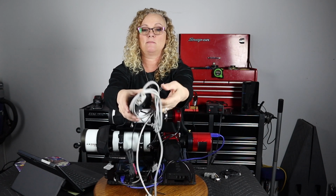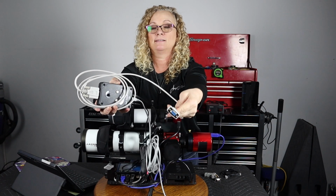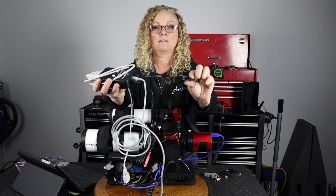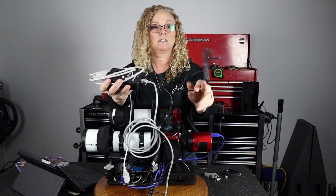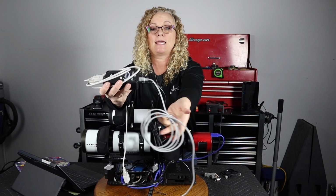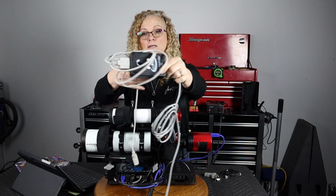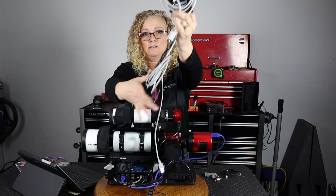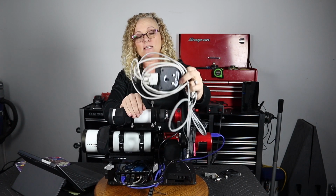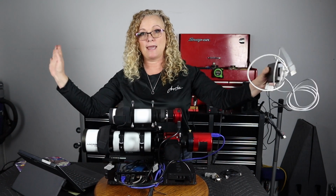It's got a cable for the DB9 and the lovely 3-meter cable that plugs into the Moonlite itself. And then out the other side, we have power, we have a temperature sensor, which is really cool to have, and we've got the USB plug. So that's a solution. It works great, no problem at all. I bypassed Pegasus and just used the Moonlite, take the USB plug to the Pegasus port, and I'm good to go.